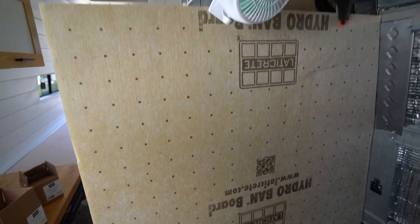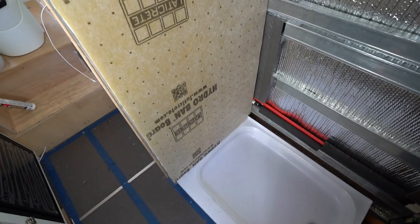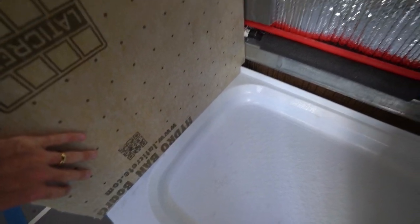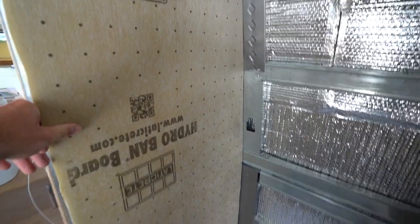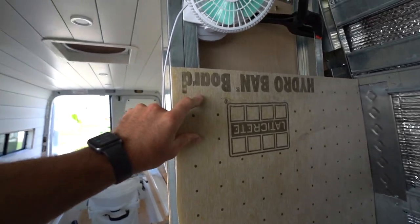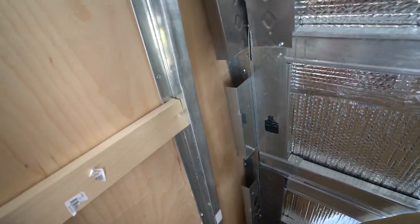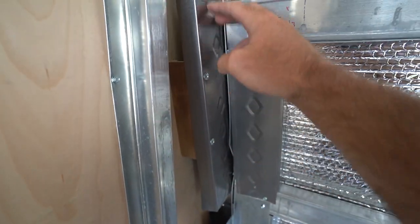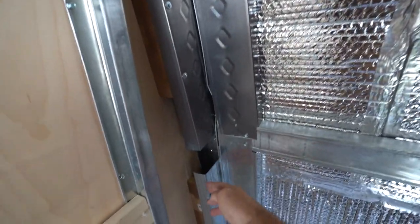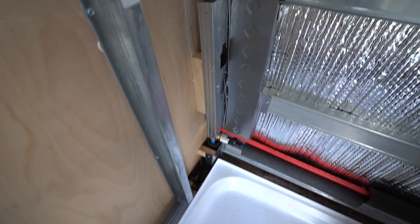This is going to be the first piece. We got a pretty solid fit — I'm going to lay it over the lip, the flange of the shower pan, so there's no way water is going to get on the other side. I have this completely against the wall. Now I'm going to take the washers and screws and drill it into the steel studs. For some spots I may have to put some wood supports so I can screw into that. I just put some wood supports in just to keep the Hydroband board from bending when I screw it in.